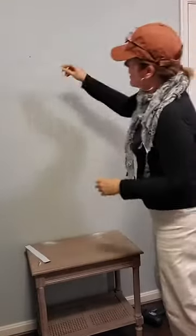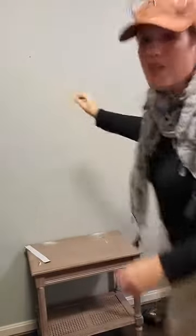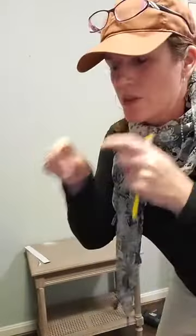And from there, I can measure where each hole goes based on the line that I just drew on the perimeter of my piece. All right. I've already pre-drilled my holes, which I'm glad I did because, tell me if anyone else deals with this, when you're pre-drilling holes for your anchor inserts, sometimes my drill skirts to the side a little bit because the drill bit just pushes it off, and you mess up your measurement by maybe a 1/16 or an 1/8 of an inch. So after you pre-drill your holes, do another measurement just in case your drill bit skirted one side or the other.